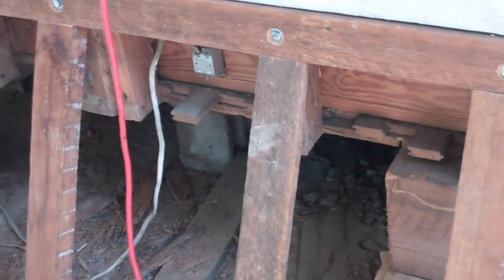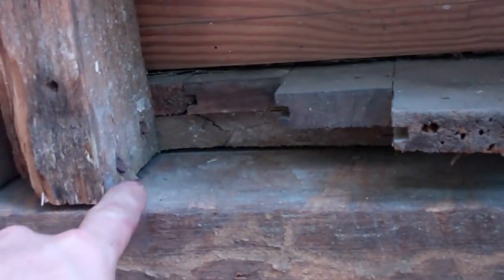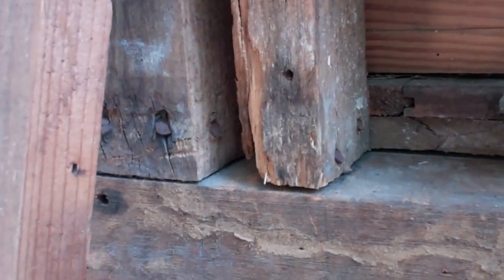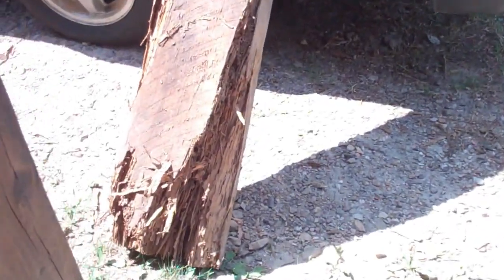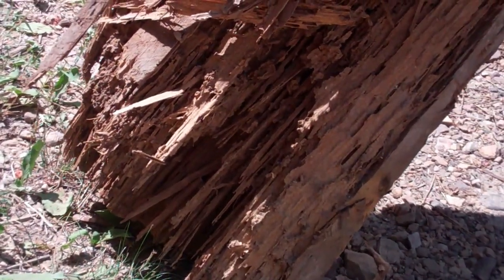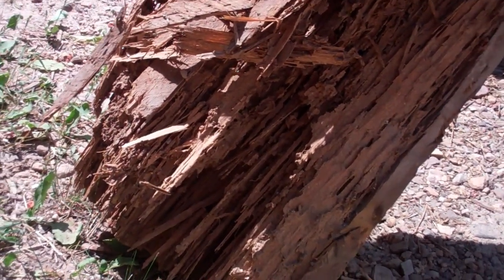And then I went along with the reciprocating saw and cut all the nails off, all the nails that went into the subfloor. So I cut through all these. I've just got this last one to do here. Cut through the nails and then took a chainsaw and cut through the sill itself, and you can see the old sill over here. That's about halfway along, and yeah, they'd eaten just about 2/3 of the wood out of these sills.